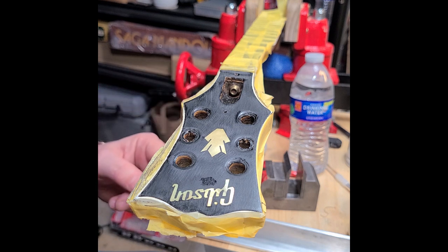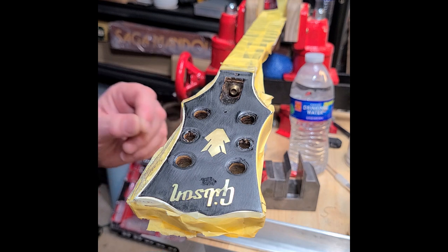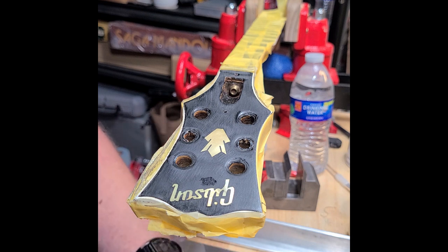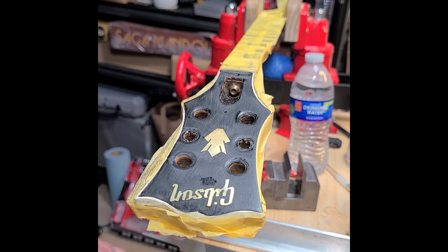It can cause a problem like that because the vehicle, or primarily the acetone that the nitrocellulose is dissolved in, is trying to escape, and the hotter it is, the faster it escapes, and it creates little pockets or bubbles in the finish. They're very tiny. They look just like little pinpoints, and it just isn't a very smooth finish. What I want is a smooth finish.